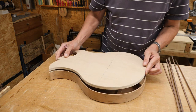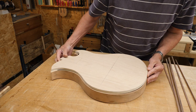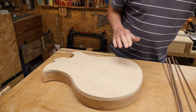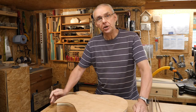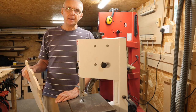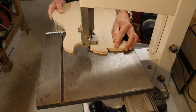Here's one I've prepared earlier. I've taken quite a bit of time to create a template which is approximately 2mm smaller than the shape of the guitar. My idea is to stick this onto my top and then route the top to the template. To do that I've had to make myself another tool. But before we get into all this routing business I've got to cut out the neck pocket from this template. I think it's about time I go for a new era of precision woodworking and I am doing my very best to get this template absolutely spot-on.